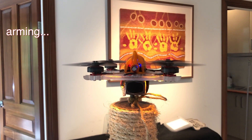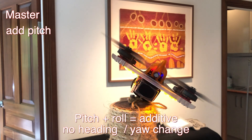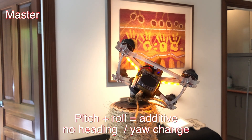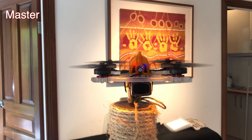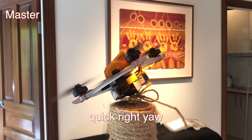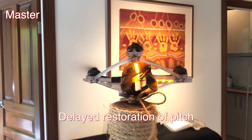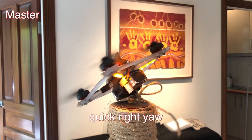This is a quick test of Chris Ross's code. This is master, where I roll and then pitch — simply additive. Now I'm going to pitch forward and yaw. The yaw will spin the quad on the axis and convert pitch to roll. It takes time for the level P controller to restore the normal pitch angle.